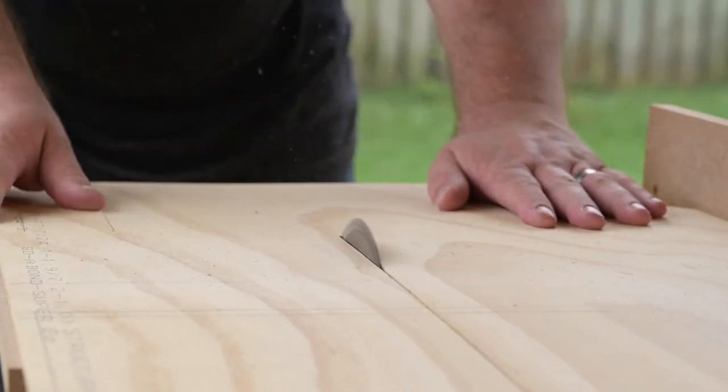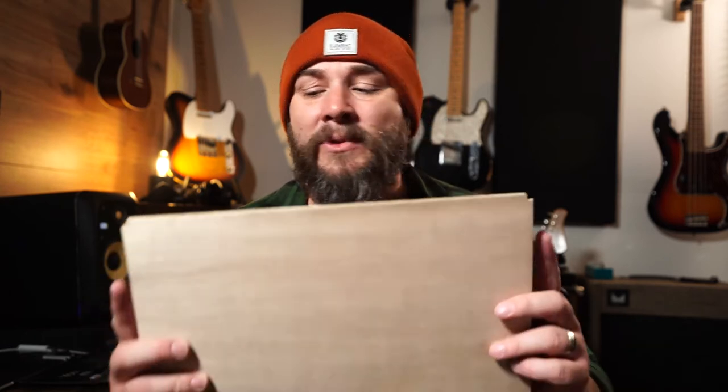So for example, let's pretend this was 250mm wide — so I was going to make an SA 250. Because I'm using 12mm ply, I would need to add 12mm to that, giving me 262mm. The reason we add that on is because later we're going to route out the edges to create a tongue, which is part of the joint that holds the board together. Once we've cut out a strip of wood that's the width of our base, we then cut the pieces for our base, front and back. The reason we cut the big long strip first is that our base, front and back are exactly the same width — so even if you're a little out by a mil, it's not going to affect your end product. They're all going to be the same width — no gaps.